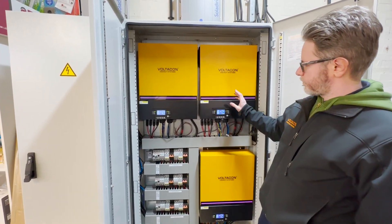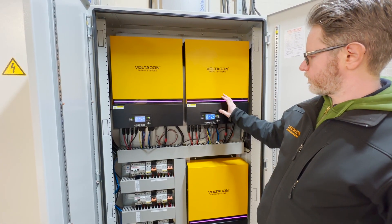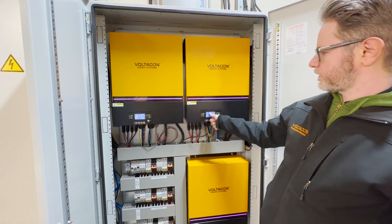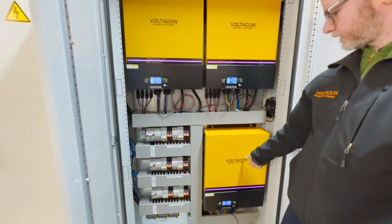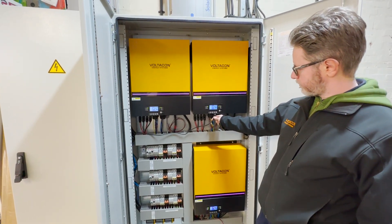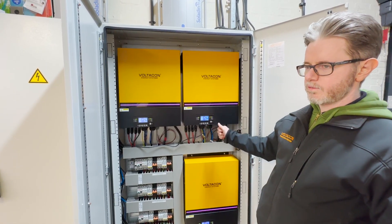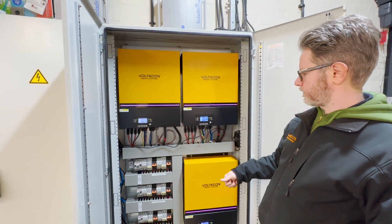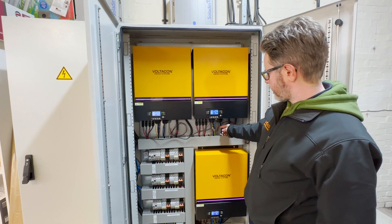We have set up the inverters to operate with a Pylontech US5000. The master inverter is HS, slave 1 and slave 2. Very important to use the right BMS cable with pin termination of 3, 5, 7, and 8 on the battery side. We have the AC output cables here.